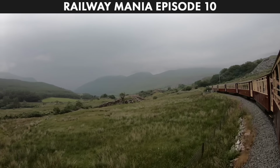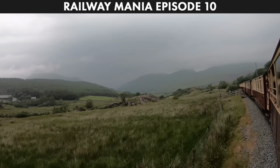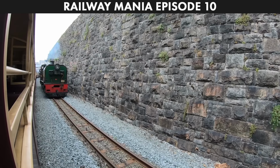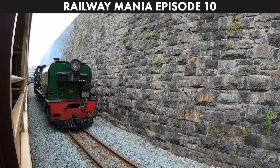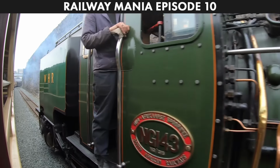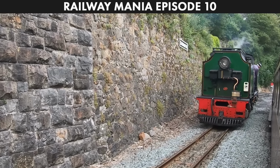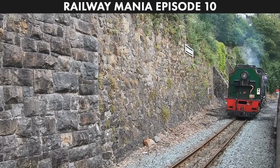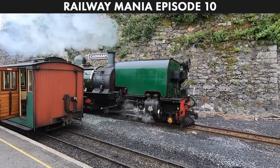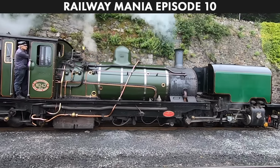So it's almost like a drive shaft on a car or a truck. Almost. In that sense, where they can slide in and out of each other to compensate for the suspension. Yeah. And something that I think it was the 1950 batch of Garratts onwards, they all had adjustable pivot centres. The idea being that you can adjust the wear out of them so they don't wear the pivot pin as much. And because of that, when you adjust them up, they do come slightly shorter in wheelbase over the years. So also the telescopic joint is allowed for that. So watch out, modelers. Depending on which year you do it, the wheelbase might be slightly different.